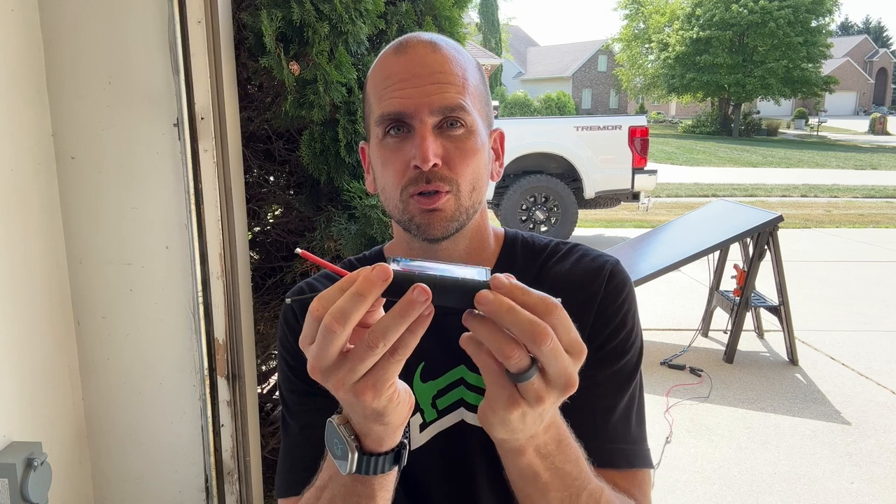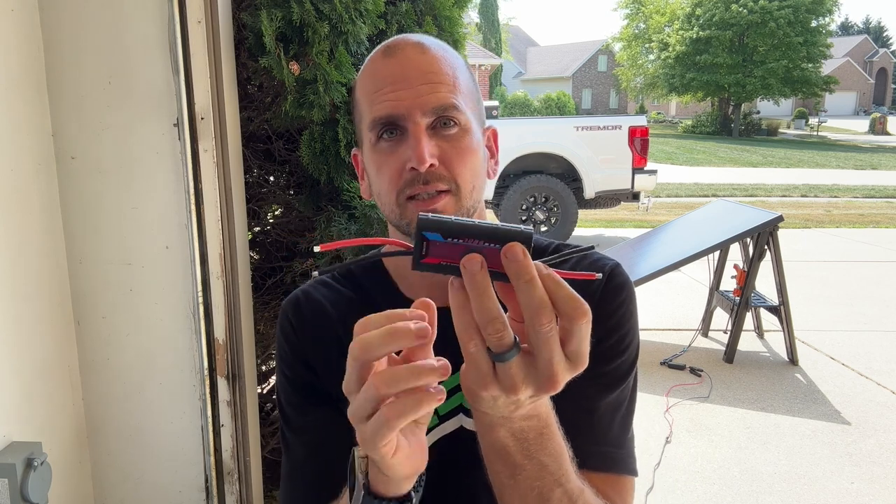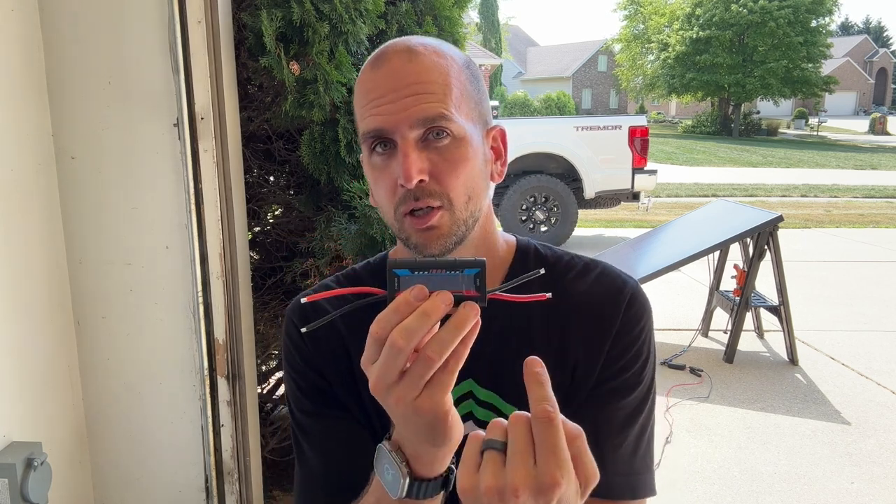Overall, it's pretty handy for troubleshooting, and if you have multiple options for how to arrange your solar panels, having one of these can really help you see the resultant voltage and amperage to make a smart decision for your DIY setup. Just know it'll come with just small positive and negative leads on the source and load side — you will have to install the MC4 connectors yourself. Don't worry, it's really easy, and if you need help there's a video linked here walking you through how to crimp and install those MC4 connectors.